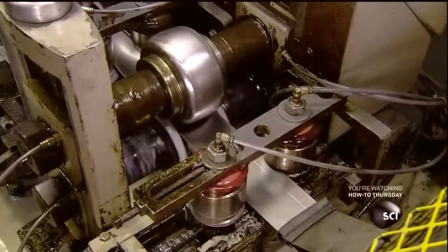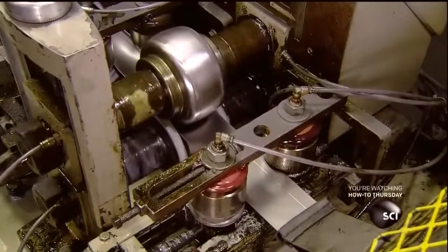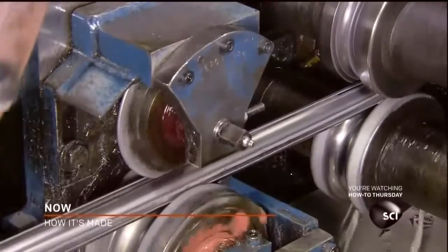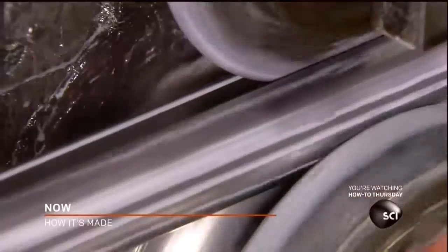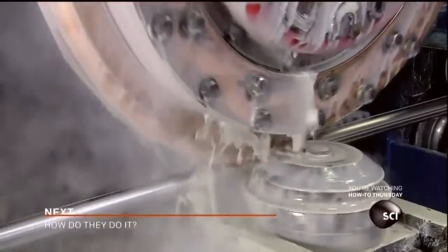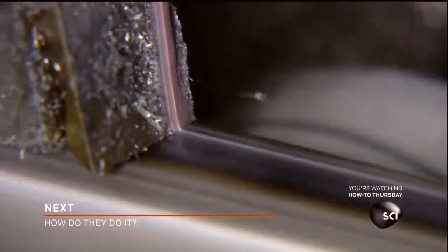Depending on the size, the coil is made up of as many as 56 circuits. A circuit is a zigzag tube, 1 inch in diameter. The mill forms a continuous straight tube from a strip of carbon steel. The rollers progressively curve the edges upward until they join at the top. The last station on the mill welds the joined edges together to form a continuous seam.